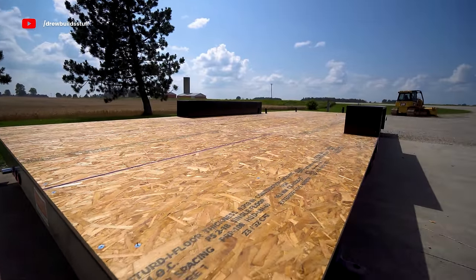Where pieces overlap, I'd give them about an inch of overlap, and then just put a nail right up through both sheets. Once I got to the end of the run, I'd make another piece with one of those 1-inch bent over end caps.